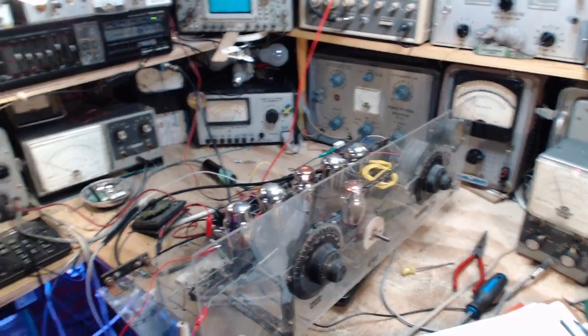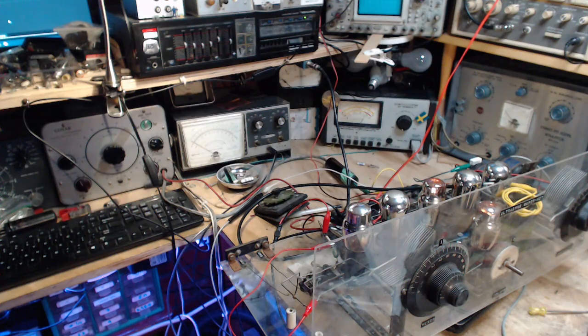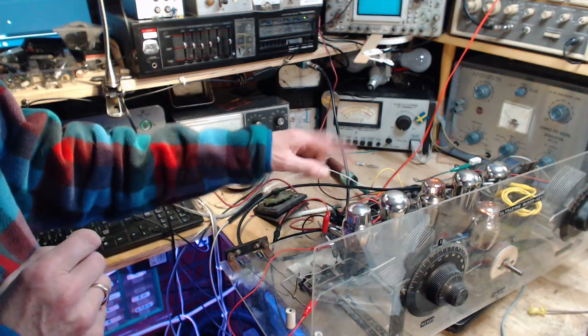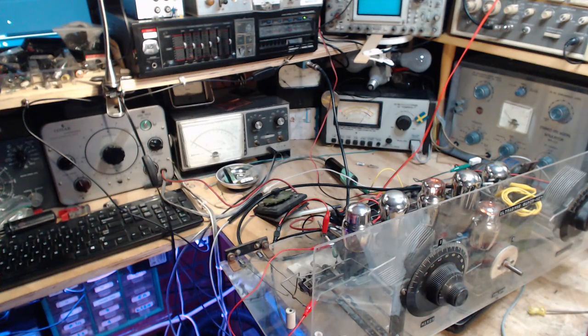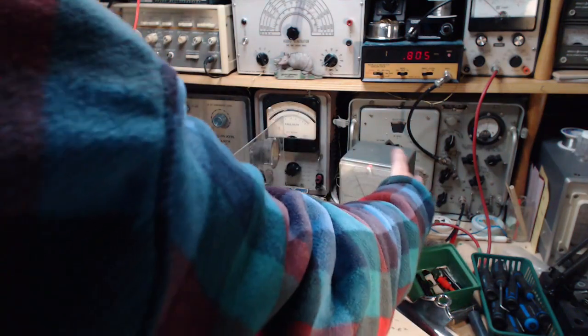Okay, next thing is we should be hearing something, but we can't unless I turn the volume up here. It's pretty much a hum, and that's all. So 10 volts at B plus. The input signal is at 800. We think the IF frequency is 75 kilohertz. So local oscillator should be at 875, all things working. But it's up at a million. So we'll raise the input frequency up to, well, let's just raise it up. I mean, if we hit the mark, we'll hear it.